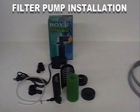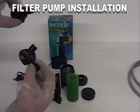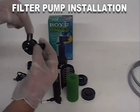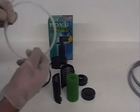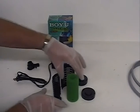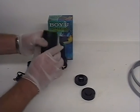This is the submersible filter pump. It's used in all plating tanks except the chrome tank. There are components here that are not required. There are two outlet caps — one has two outlets, the other just one. We need the one with one outlet. The thin length of tubing can also be discarded. The filter can be changed for a bag of activated charcoal when an organic cleanup is required — see the manual for details. The pumps come already assembled; all components are snap and click assembly. Make sure you remove the pump from the solution every day.